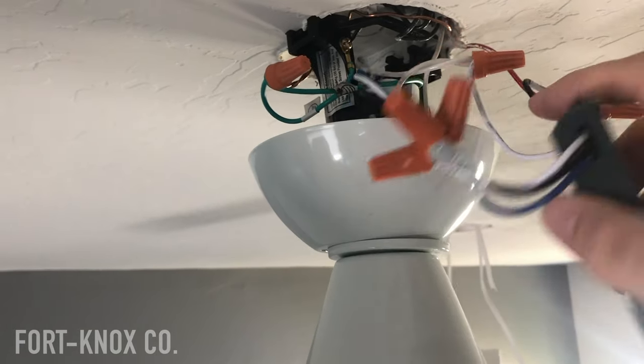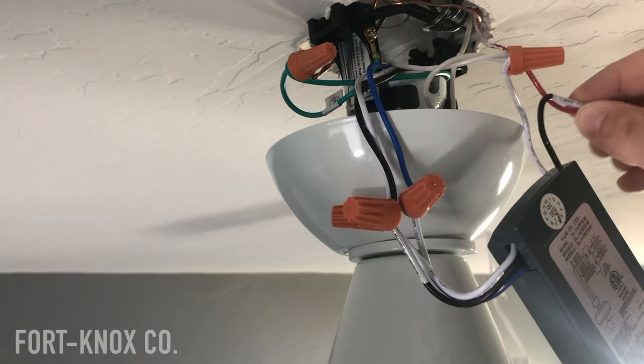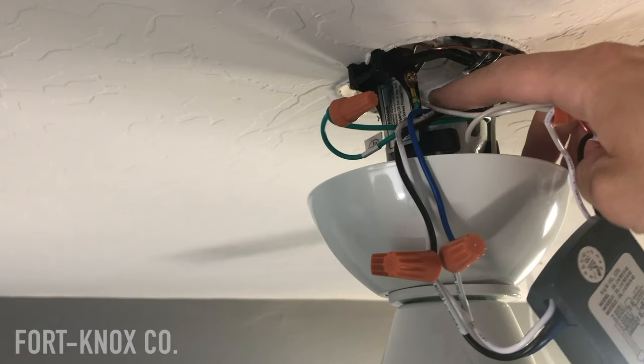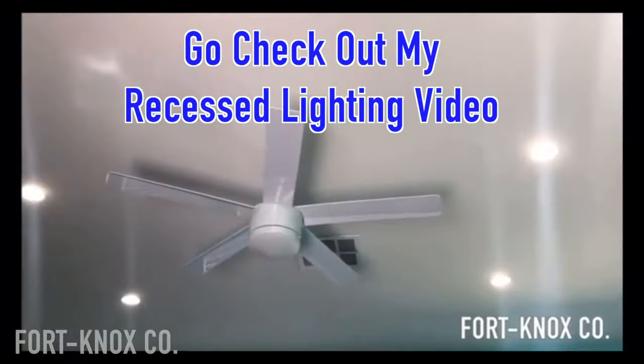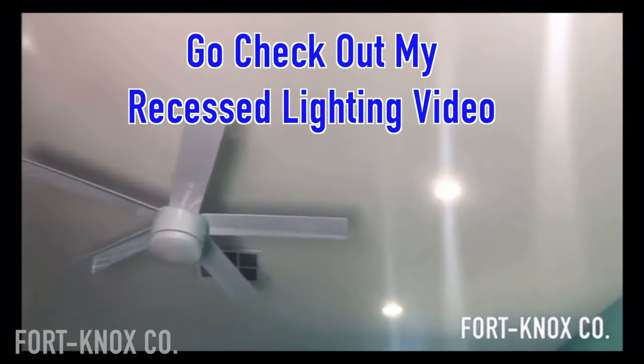It's always a hot and a neutral — black and white or red and white. That was pretty much it. Once I got all those wires inside the fan housing organized and mounted back up and cleaned up, I just had to connect the last few recessed lights I hadn't installed yet. Those were all daisy chained together, and now that I have the power in the main recessed light to start the circuit off, it was good to go.